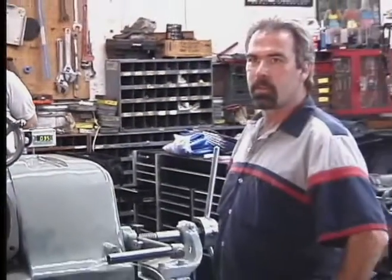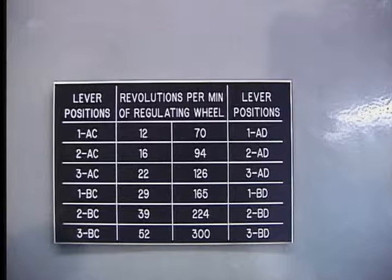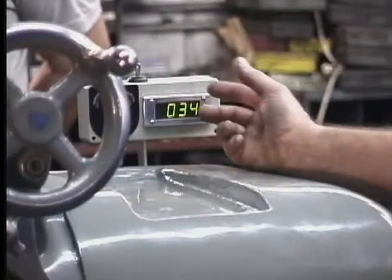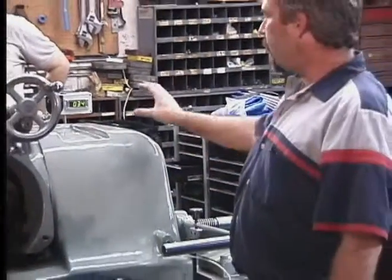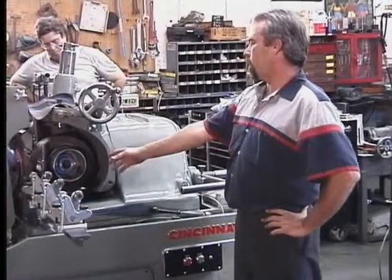You're not fixed like gearboxes. With gearboxes, you're stuck on certain speeds — you have fixed speeds. It will go from 22 to 29 and there's no in-between. With this system, you can get one RPM difference. You want one RPM? You've got one RPM. And it's true right off of the feed wheel — it's not a guesstimate. It's truly reading exactly what that's running.